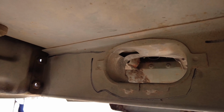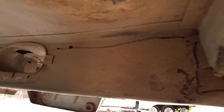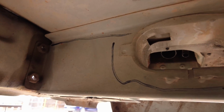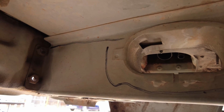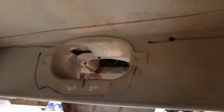So the best time to do all these stiffeners is if you have the rear axle pulled out, just to give you all the room underneath to hit it. The reason why I have my axle pulled out is because I was in the middle of doing an axle truss and shock mounts. I will have a link to that video in the description. But I figured since I will have everything pulled out from the bottom of the Jeep, including the gas tank, this will be the best time to do these stiffeners.